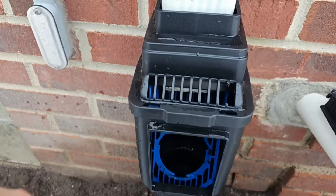With a fish tape, this black handle slides. Basically you push this black handle and keep pushing it — it takes the cable and coils it up super nicely. Really important: a lot of people just try to pull this and it gets all wadded up inside and won't work well. You want to actually rotate this orange part, let the black part go around, and it will automatically coil nice and tight for you. So we have the string all the way through.